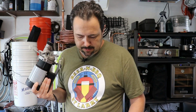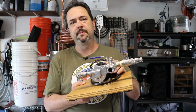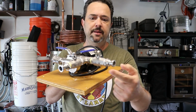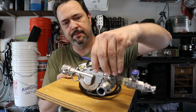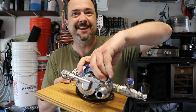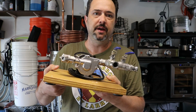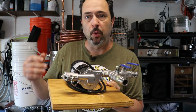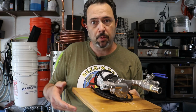Let's see. So I mentioned the occasional runtime issues with the Chugger pump. It would go on the fritz. It required manual priming, which I actually addressed by adding this extra check valve here. Oh yeah, this darn thing's sticky too. See, it's already giving me problems. So I did fix that problem. It was also unable to bleed the air out of the lines, but fixing that was an extra expense, well above the cost of the Chugger pump. So the RipTide comes with one, right?